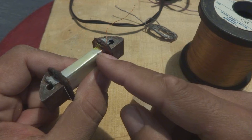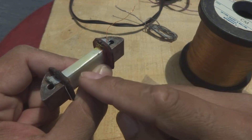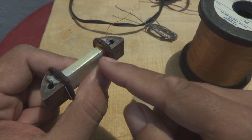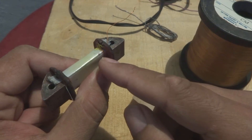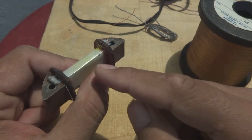That will be a problem with the voltage — while the voltage is being induced, there will be a big voltage difference between the winding wires, and that will create a short or a leakage in between the turns. That is not a desired thing — the corona will occur, or short circuiting will occur in between. That's not desired. What we are doing is we will proceed like this.